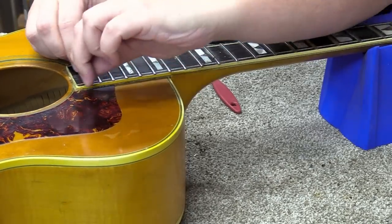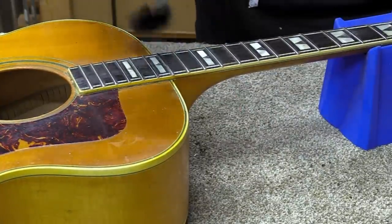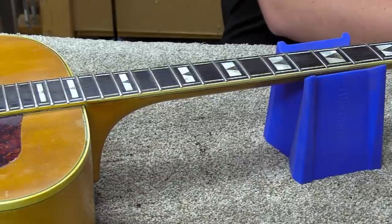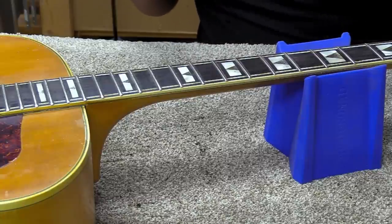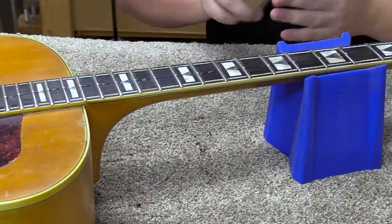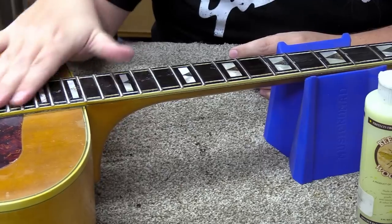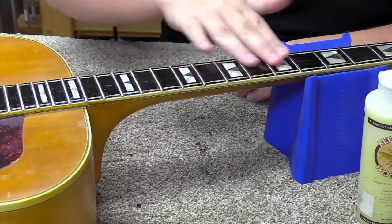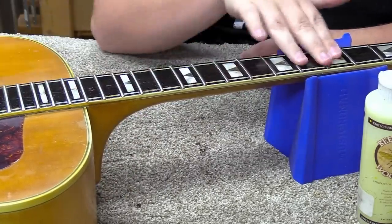We've already cleaned up down here a little bit because of that crack — I just want to make sure it's nice and even. Okay, so with that done we can oil this fretboard. This needs oil badly — it's dry and brittle, it should have been oiled several times before now. I'm using this wood oil — it's like butcher block oil, that's the intention for it — and it works really well for fingerboards. There's a little bit of beeswax in there which helps keep them moisturized properly and kind of smooths everything out, giving it a very easy feel.